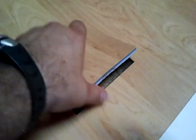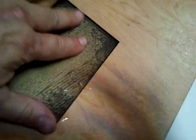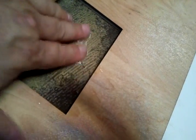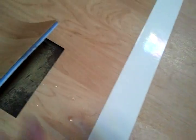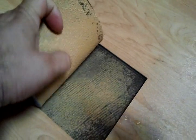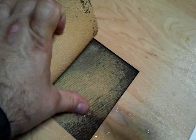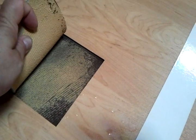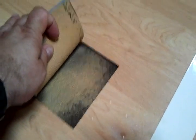Here's a larger one I cut open just a short time ago. As you can see here, I pull this open and you can see the presence of water — you can see the water moving around my fingers. You can see where the adhesive has made the bond between the backing and the floor, but the pressure of the water had separated it so quickly before it cured, and it just got worse over time.